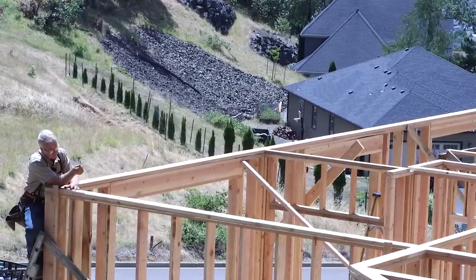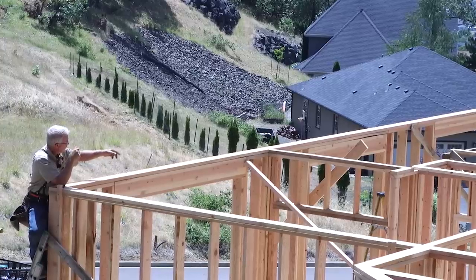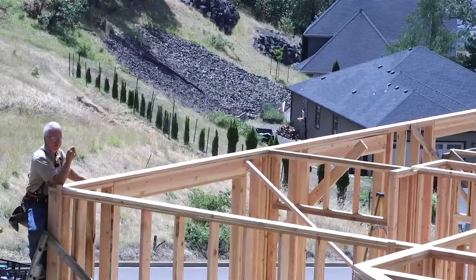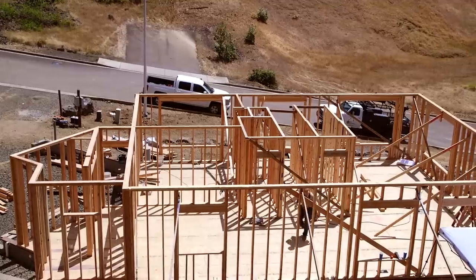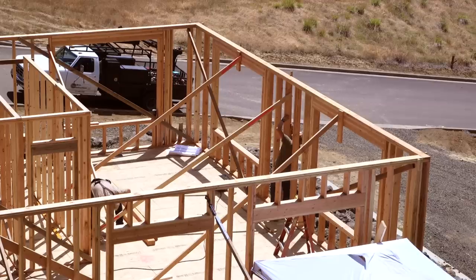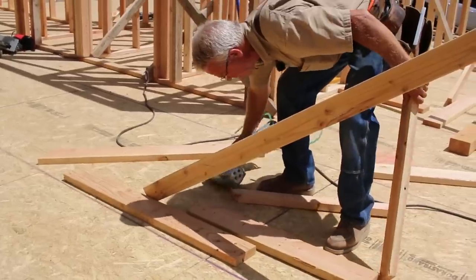I will just brace and push or pull the walls in between the intersections until a 1.5 inch gauge, run up and down from the bottom, tells me, yep, the wall's 1.5 inches away from the string, all the way up and down, all of the exterior walls. There are other ways to get this done if you don't have turnbuckles. They all involve controlled leverage, and you will see us use various methods during this process.